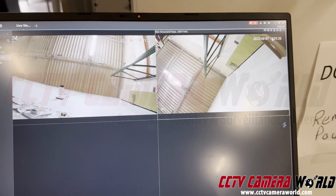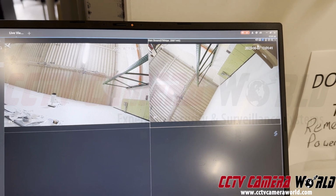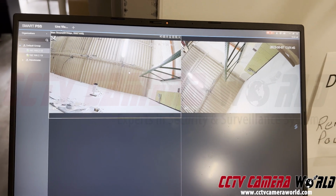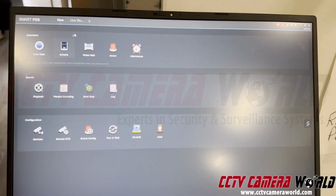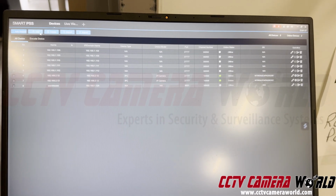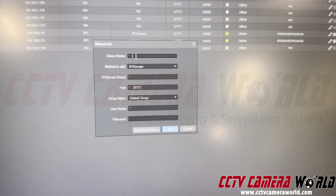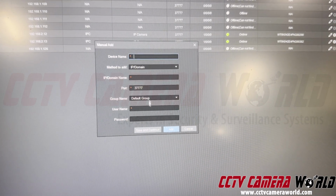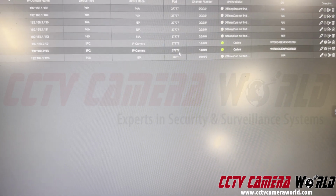And here's, for completeness' sake, a second camera. Right, that's there. And keep in mind, you can only watch 1 camera at a time. To add these cameras, you have to actually go into Devices, search your local network, press the Add button, and type in your IP address. Give them a name. Give their IP address, like I showed you when I was adding them to the iPad. Username and password, and add 2 of the cameras. And I have 2 entries for those cameras right here.